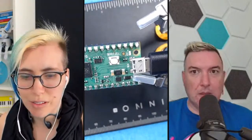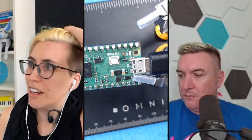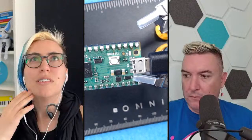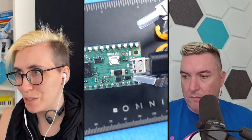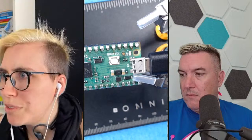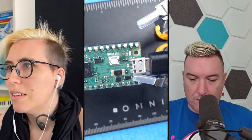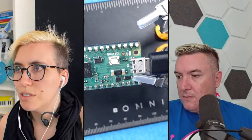This code did not throw an error. All it's got right now is import time, import board, from digitalio import DigitalInOut, Direction, and Pull. So you're importing some stuff, and then it says LED. Oh my goodness, is it what declares the LED, instantiates the LED, creates the LED in the code? It says LED equals DigitalInOut(board.LED). Yeah, DigitalInOut is from digitalio, and is that an actual library on the board? I don't think so. No, that's not part of Adafruit HID as far as I can tell. But now I've got that. Okay, and then if I change it to false, okay, so save this to the board.